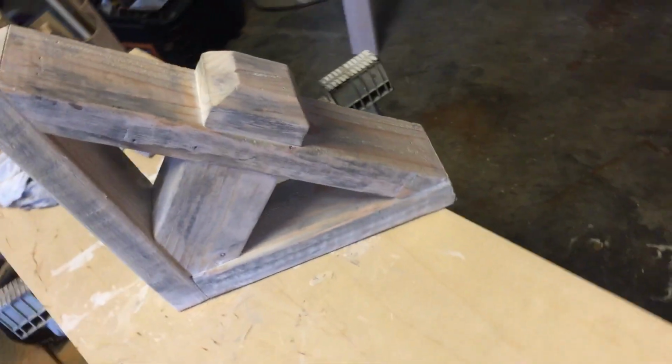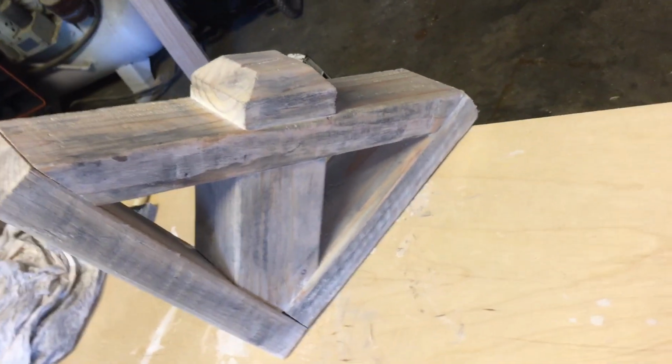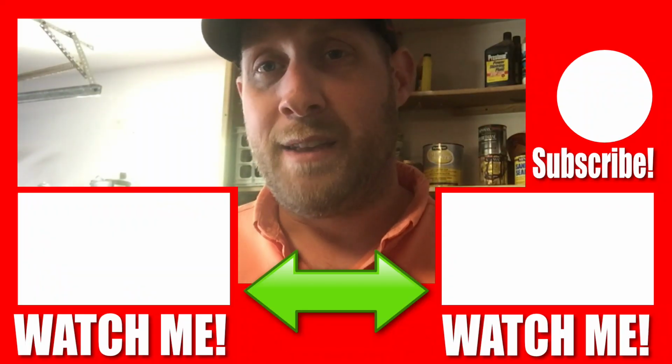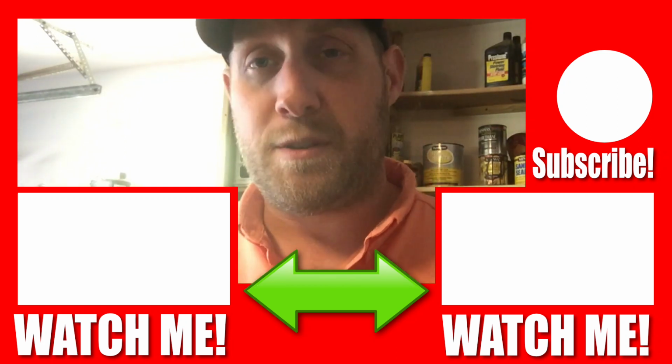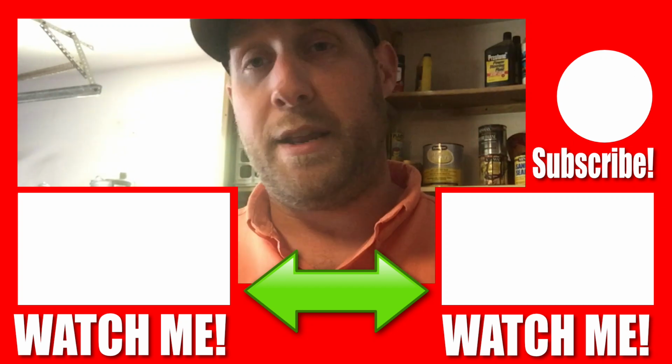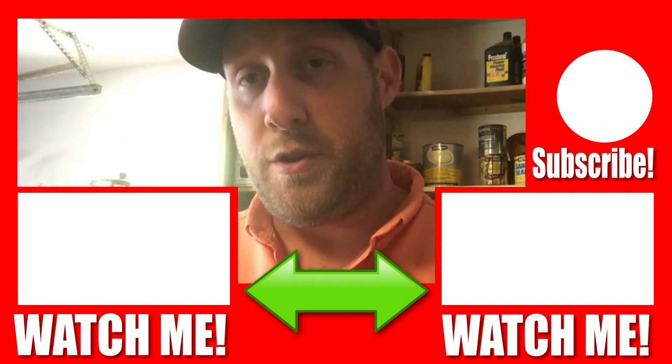All right, everybody, what'd you think? Pretty simple, right? One 2x4, maybe 20 brad nails out of a brad nailer, and some stain, and that's about it. You're talking less than $10 to make this beautiful corbel that you can use inside the home, outside the home, decorate it, use it on a table. I don't care, just use it, just make it.